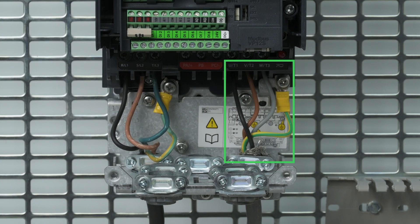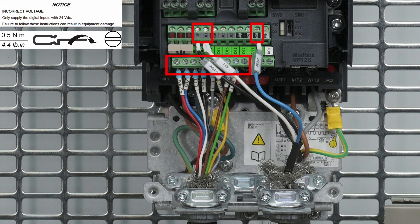To improve electromagnetic compatibility, please use shielded cables to connect the motor to the drive. On the control part, perform the same operation with both the potentiometer for speed reference and DI for run order. Please use shielded cables for analogic and digital parts and keep them separate.